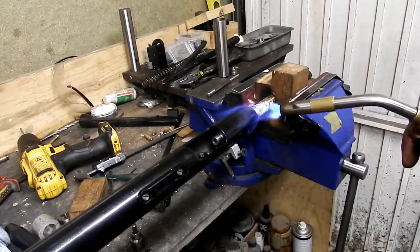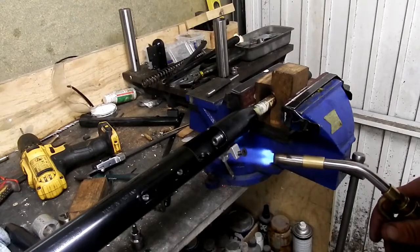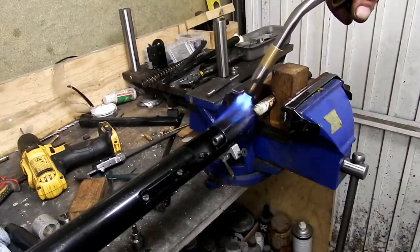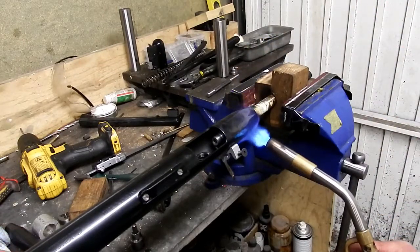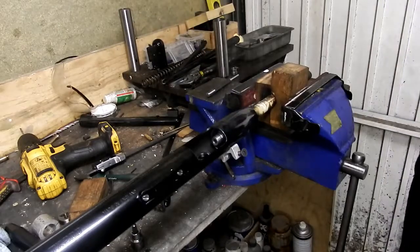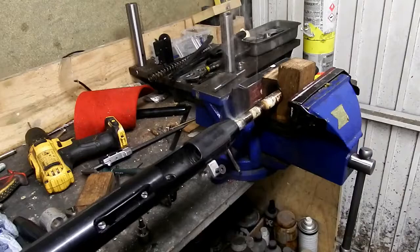Then hopefully we've got time — a little bit of heat around here because they lock-tight them in there too. You've got exactly the same scenario where as soon as that Loctite gives way, out comes your barrel. Of course if you're having a full caustic black job — or in this case Cerakote — I would rather these guns are completely dismantled than risk caustic salts wedging themselves in there and then you spend the rest of your life with them rusting from the inside out. You can see the smoke on the inside now — looks like it's giving way. Twist once again, and out she comes.